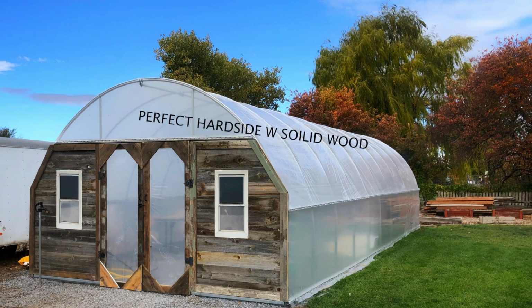Another little thing I want to throw out there is a lot of times I will see somebody hard side their in wall and they'll use OSB or a chipboard type of thing. Just keep in mind that particular plywood, and in my previous life at Home Depot, I was part of the lumber department, and I've actually been to these places, I've seen this made, I've talked to the manufacturers. That is not an exterior glue.